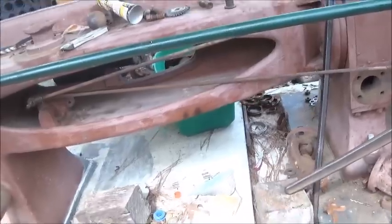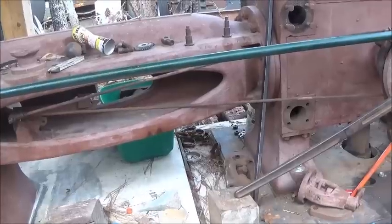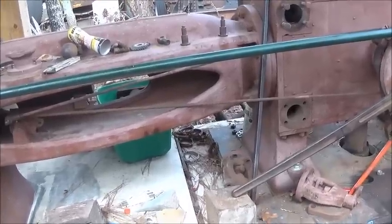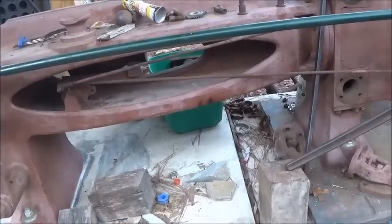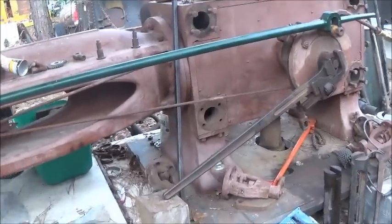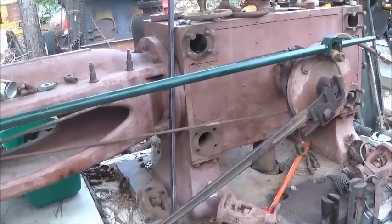It's at a buddy of mine's, because his lathe will chuck 14 inches. It'll chuck that piston. We're having to mill it out or machine out the center. We're going to sweat fit it and pin it. Before that, we're going to thread it and get it ready to put on. It's a chrome plated rod, like a hydraulic cylinder rod. So, all right, let me show you what I've gotten done here.